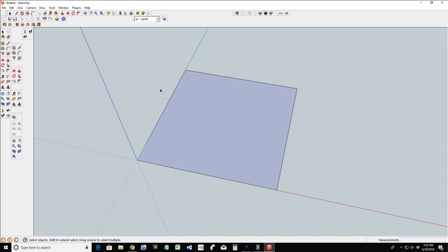And so let's go ahead, I want to draw out a place. I'm going to snap to the center of this and I'm going to create a small little area here with a half inch circle. And if I snap to this side, do the same thing with a half inch. Oops. Let's undo that. I put in the diameter instead of the radius, 0.25 radius. There we go. And in the center here, I'm going to create my 1/8 inch radius, which would be 1/4 inch for my 1/4 inch dowel.